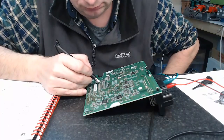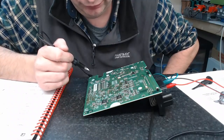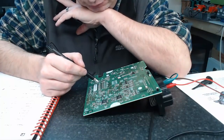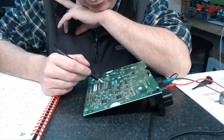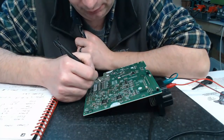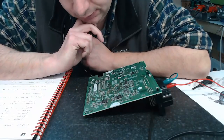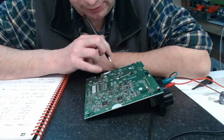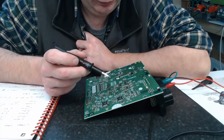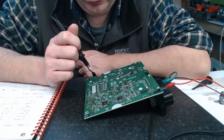These are all pull downs. So, if we wanted to take this over for our own nefarious purposes, what we would do is we would remove all of these resistors here. So there's 14 of these little resistors, and we could then solder our own wires on here and drive each of the gate drivers with our own system, so that we could actually test things and determine which transistor does what.